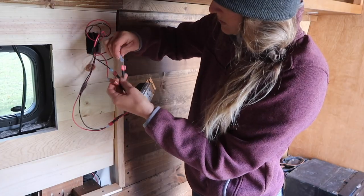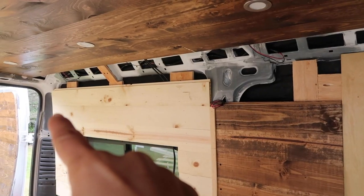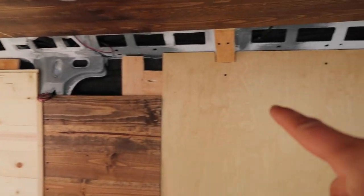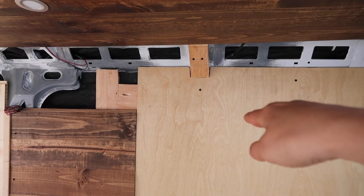There are a few little things that I need to touch up before I can make really precise measurements and figure out exactly what my design will be, and make sure that I know where I want my light switch to be, because I will have puck lights on the bottom of the stretch of cabinet. I'm going to do something very simple — first I'm just going to be screwing a two-by-two across the whole bottom of my cabinets. That's where I will be placing the half-inch plywood on top.